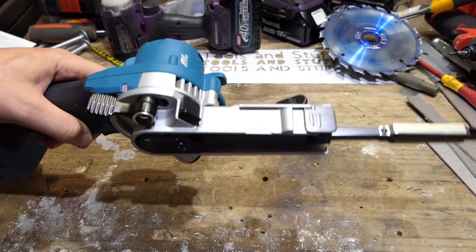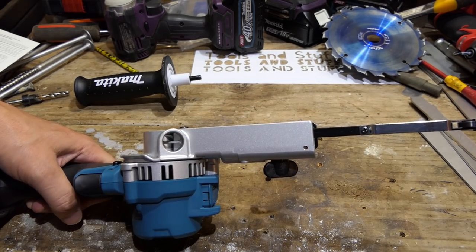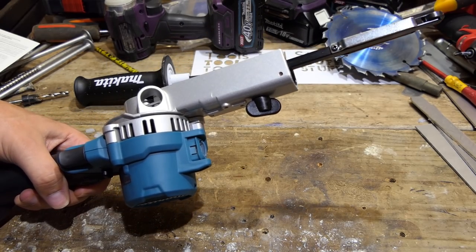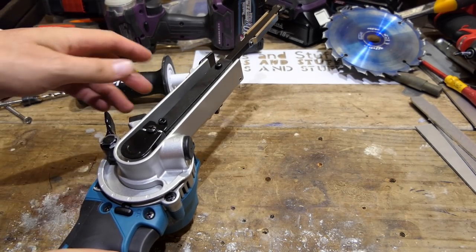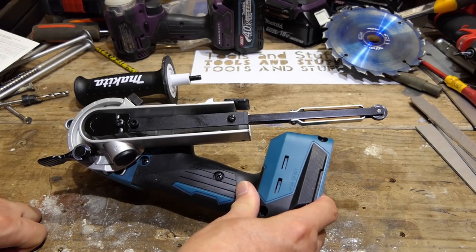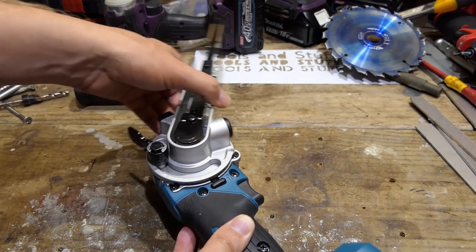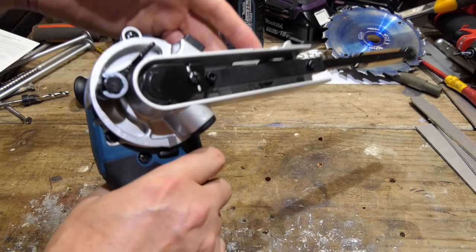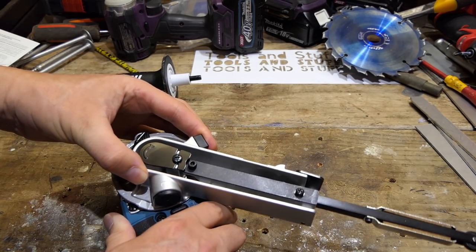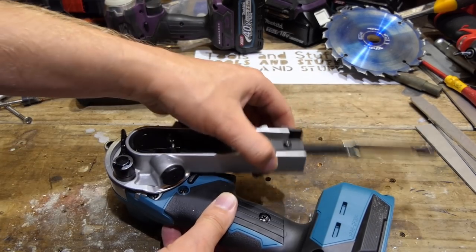On the bottom here we have a bung for dust extraction. I don't know how useful that will actually be — it's very small, looks about 22mm. It moves and goes right round, almost 180 degrees, with a positive stop at 90 degrees. So it's kind of like a drill or pistol style grip. You can release this switch here and take it round further if you wish — useful for storage so nothing gets damaged sticking out.